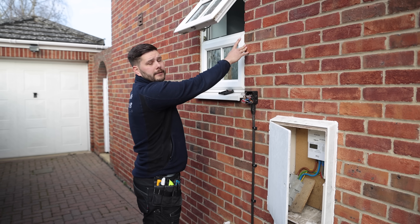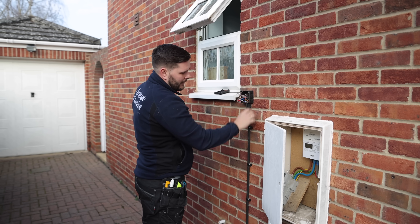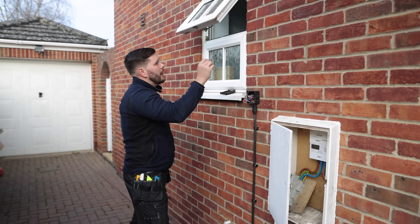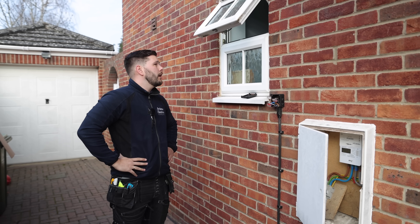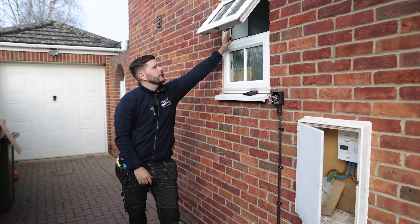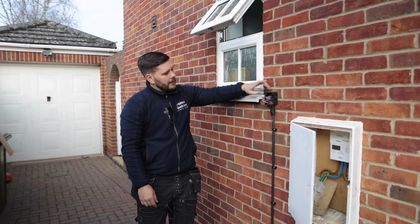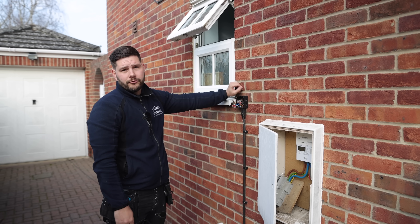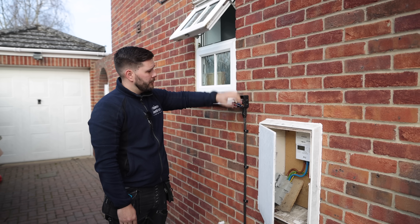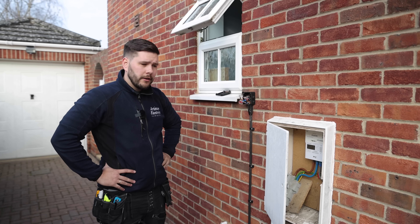This is a solar that feeds straight into the board behind. We're going to try and replicate exactly the same — bring the cable up in a whisker box here and feed it through to the board. There's not much room around the board either. So what we're going to do is bring a bit of twin and earth, bring it through so we can run it in with the trunking with the rest of the cables. Bring it down, put a whisker box on, and then put the high-tuf cable back to the Zappi.